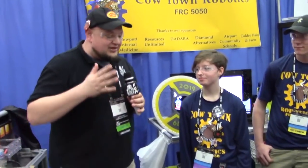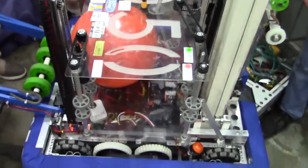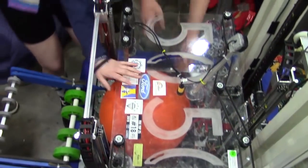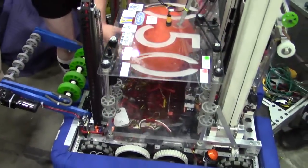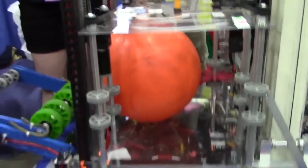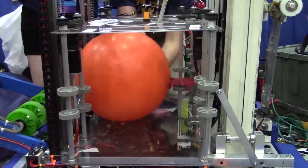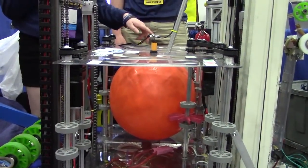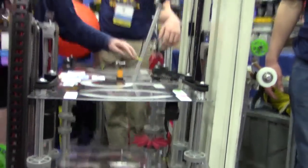Something that was really cool — you have a left-right chute on your robot that's been very effective. So Bridget, why don't you tell us about that? So our left-right shooter, we take in through the front right here. There's a little intake mechanism, and there's an IR sensor right here that will stop the ball once it senses it in there so it won't shoot out either side. Then we can determine, just with the press of a button, which way it shoots out of the left-right shooter. We only use three motors — one right here, one right here, and one in the back.